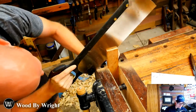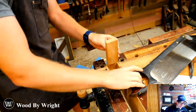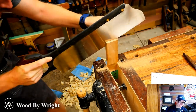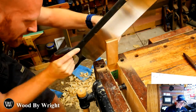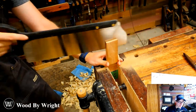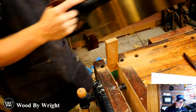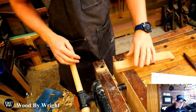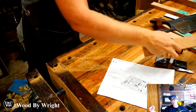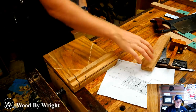I go down to that depth mark, then I can turn this whole thing around and stay on my side of the line — which is now the other side of the line. It's amazing what sharp teeth make. Once I've cut down at an angle on both sides I can flatten it out and cut down to depth. This cherry is so nice to cut when you're used to working with oak. So now we cut the cheek — excuse me — now we can cut the shoulder.